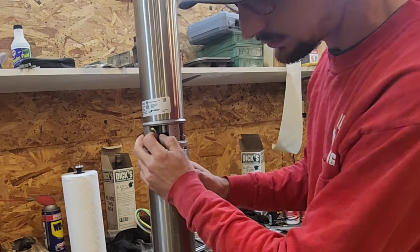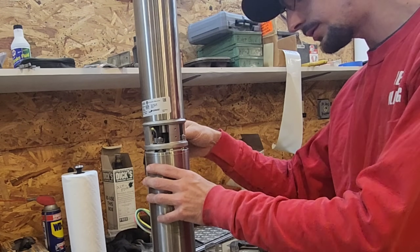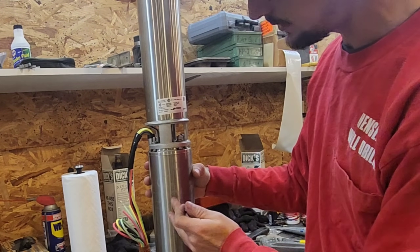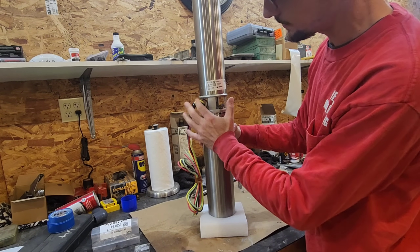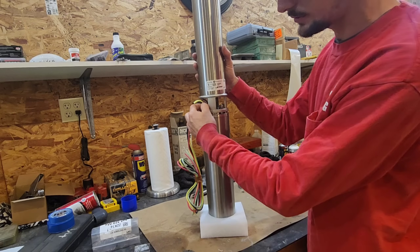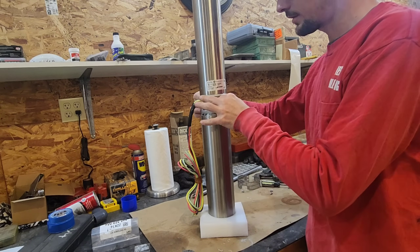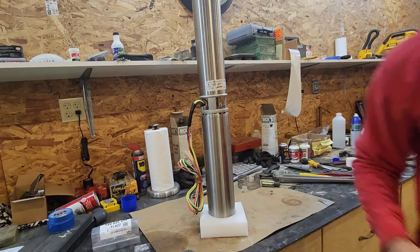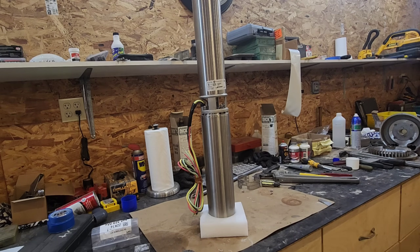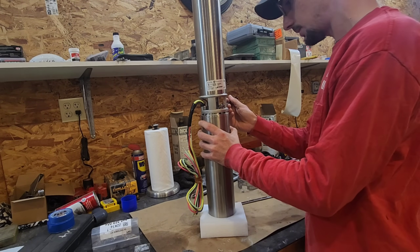They all come pre-assembled, but when you come to a larger system like this they're sold in two pieces, where you can either replace the pump end or replace the motor end. In this situation the motor is actually bad and the pump end is only two years old, but the individual said no, we just want to go ahead and pull it out, replace both, and keep the old one as a backup and replace the motor at a later date.